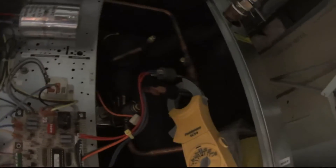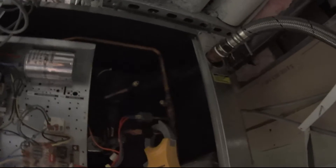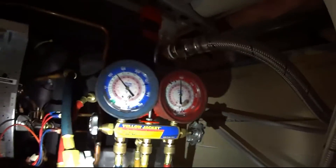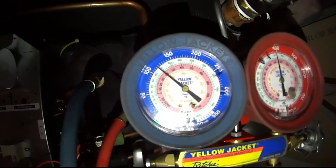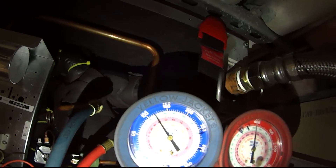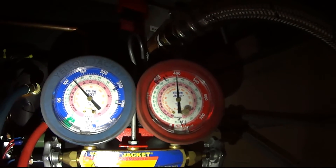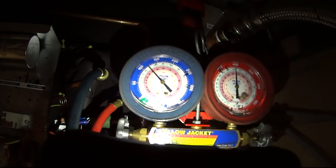Just waiting on a signal, gonna connect — I got all the water lines connected and no leaks. Just got to get my gauges on there and I'm just going to test it one more time, just going to show you the pressures. See, downstairs when we were testing it, because the water was so cold, it was throwing off our pressures. But this is what we have — it's about 110-115 back pressure. Originally my back pressure was at like 10 and head pressure was up to 600. Now to replace the TXV valve — with the new TXV I got 110.